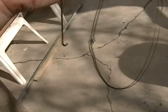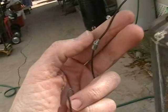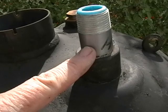So what I did was I got a smaller wire, and I made a smaller hook, and I ran the wire down in each of the tubes as far as it'd go. And on one, the wire ended here at this mark, and on another one, the wire ended there. So that meant one of them was the hot and one was the cold. So I marked it: the hot has to be upward in there. And it just so happens, see, experience is a good teacher, it turns out that the overflow valve is on the hot side. So that's a confirmation.